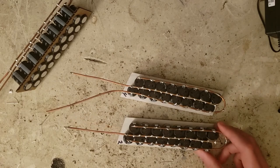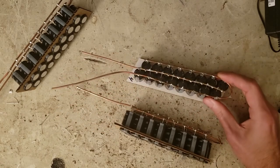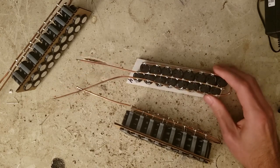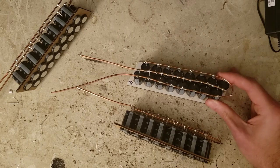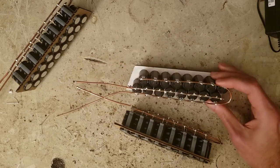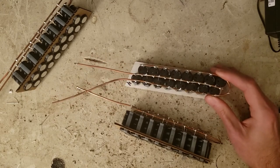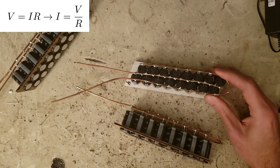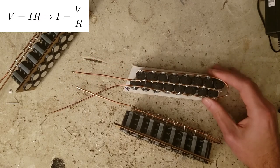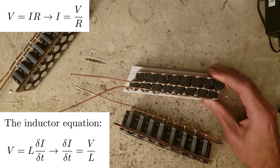There are a lot of ways to physically arrange these. They're shaped sort of weird with the cathode wrapped around and the anode emerging from one side. The main goal in this stage is to minimize parasitics, which is just what we call unintended components that exist, like the resistance of the wire. The wire has some small resistance that I want to minimize, because the lower the resistance of the whole pack, the faster my power pulses can be. I also want to minimize inductance, because that can slow down my pulses too.